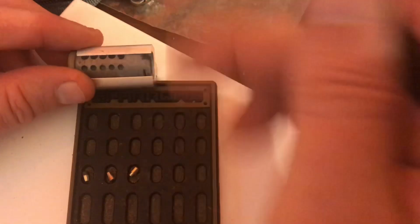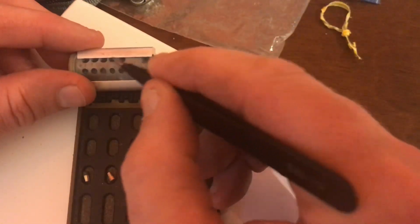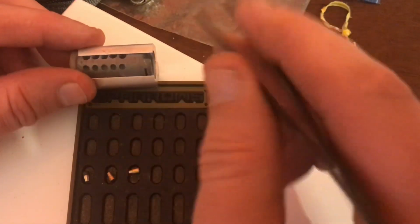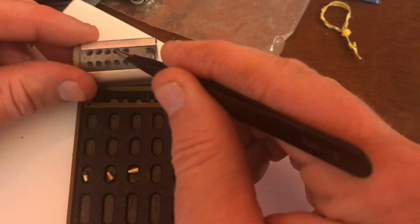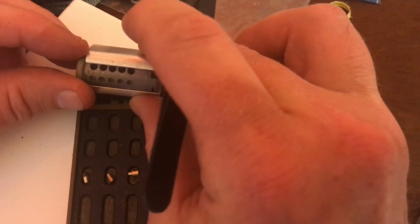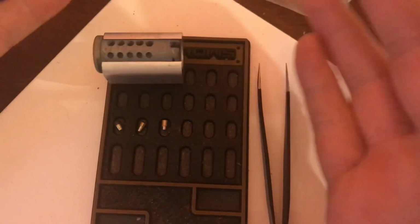It may not be as deep as it had been with just the T-pin tip, depending on how narrow you have made that. But you may be able to get it to pop up in there, and they may not realize, or they may realize, that they've got an overset. And of course, as they try to adjust and allow for that, they may take off some tension and let the core come back a little bit. Because it's reduced, it's not going to take as much of that chamber opening, and you can get that little nub to drop back in again. So yeah, there we go.